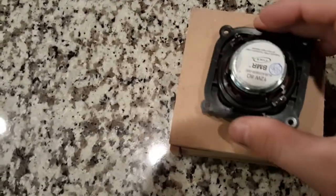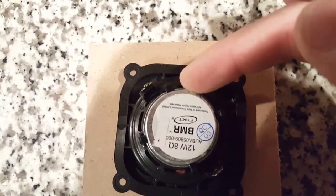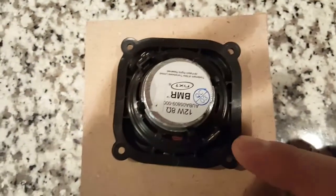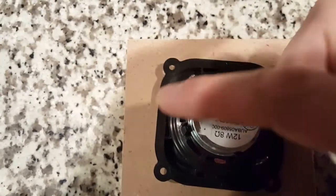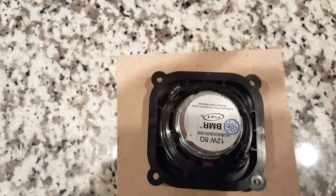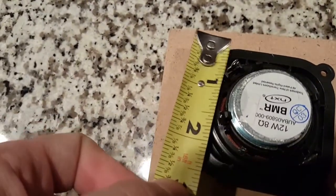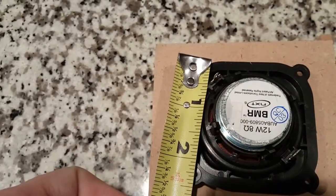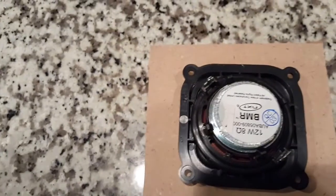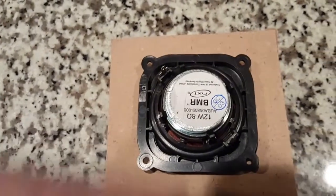You need to check that out first because if you don't, you're in a lot of trouble. I did look over these speakers — they have about enough clearance. If you want to measure the cutout size, you're going to place these on top of the box and measure from the outer circle where these pins are. You need to make sure those pins are inside — that's about two and an eighth inches. You could even go two and a quarter, but make sure you don't go past two and a half inches or it's going to show on the outside. So two and an eighth to two and a quarter — I'll find something around two and an eighth, cut it out, and Dremel any remainder if needed.